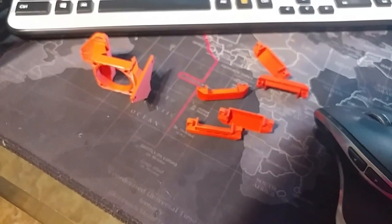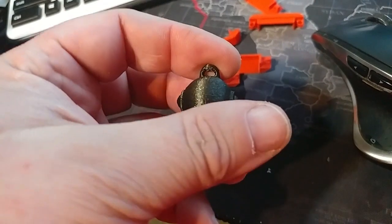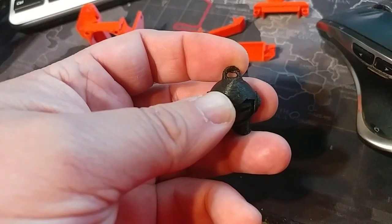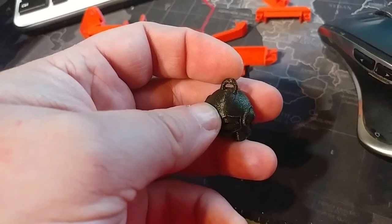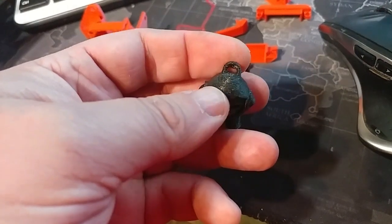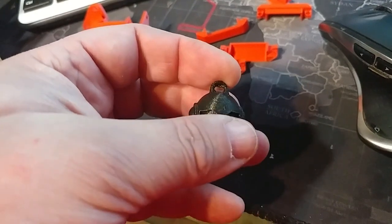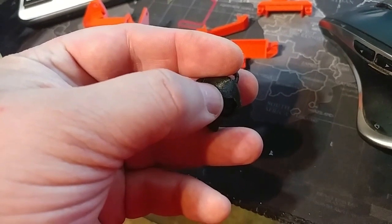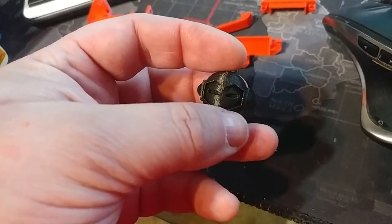There's another example of that. Wee little Marvins. For whatever reason, Cura does a significantly superior job on this little keychain hook. It's actually tangible and strong with Cura, but almost always useless in Simplify 3D. I mean, it's a slicing engine, so clearly there must be a way to adapt it to do this better, but Cura does it out of the box. I'm not sure why. I'm wondering if I've tweaked a setting in Simplify 3D that makes that a little harder for some reason, but Simplify 3D does a lot better job with these overhangs. They're much crisper in Simplify 3D than they are in Cura.